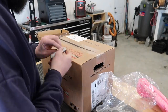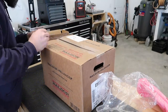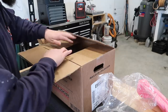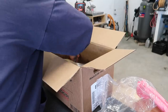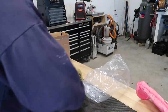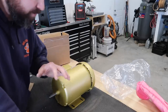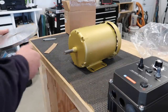The basic concept: this grinder is a super simple thing to build. It'll get more complicated when I make the adjustable table, but a disc grinder can really be this simple. I bought the good stuff — this is a Baldor TEFC motor, which stands for Totally Enclosed Fan Cooled. That's what you want for a disc grinder or belt grinder because dust can't get into the motor itself.